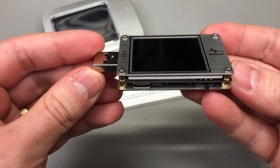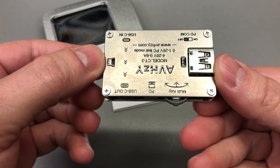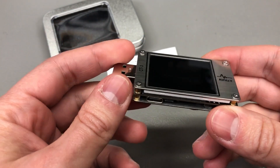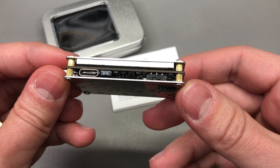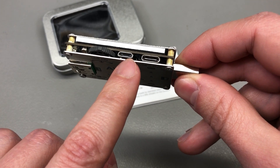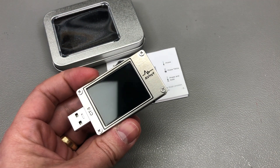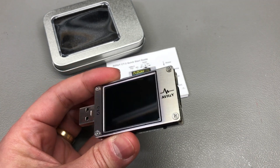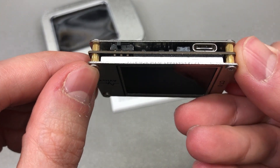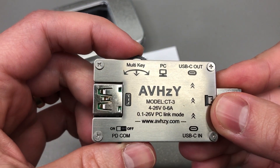This is your typical USB meter sandwich construction with different layers. This one seems to be using a single PCB in the middle with a couple of metal sheets on the outer layers, which makes it feel premium and more rugged than simple plastic. We have the typical USB Type-A connection for input and output, USB Type-C input and output, and also micro USB for the PC connection. The LCD is 128 by 160 pixels at just 1.77 inches. You can see those pixels but for a small USB meter it's still very readable. From the silkscreen markings on the back we notice the controls: there's a switch to enable or disable power delivery control, and a multi-way switch for left/right and push to navigate the menu.